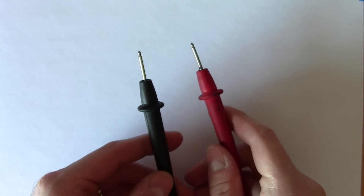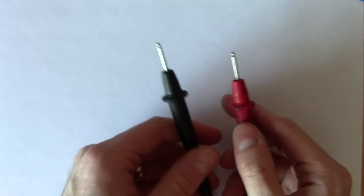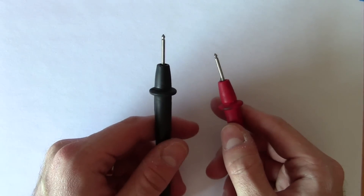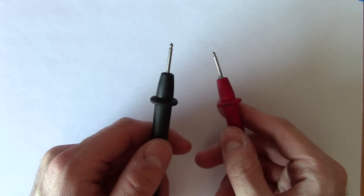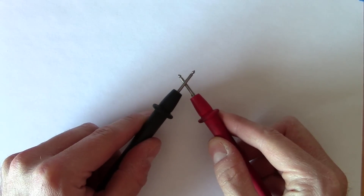For today's work, all I really need to do is check continuity. When you're checking continuity, you can do it one of two ways. You can either set the thing for ohms and watch the display, or what can be a lot easier as you're probing around inside these tiny little devices is to set it for an audible continuity mode, in which case it beeps when it detects continuity like this. Convenient, isn't that?